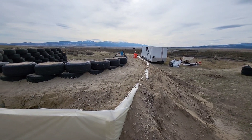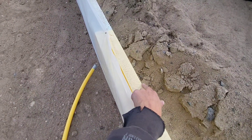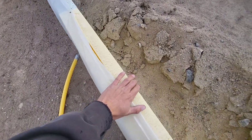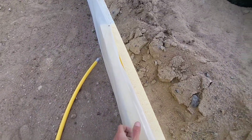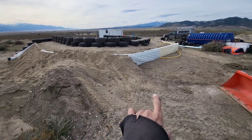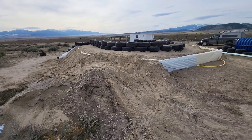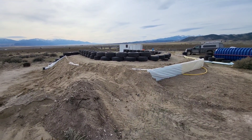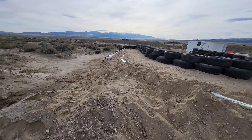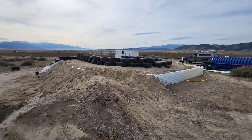Everywhere else I leveled across and then just piled dirt on top. If I were to do it again, I'd probably wrap the plastic a little more — overhang it a few inches — because when we started piling the dirt on, it would pull the plastic down. Over on this side I'm just making a little ramp to get dirt up onto the berm so we can pound tires. The sixth course is pretty much all pounded and I got part of the seventh course up. East side is kind of the same — leveled across and dirt piled on it.